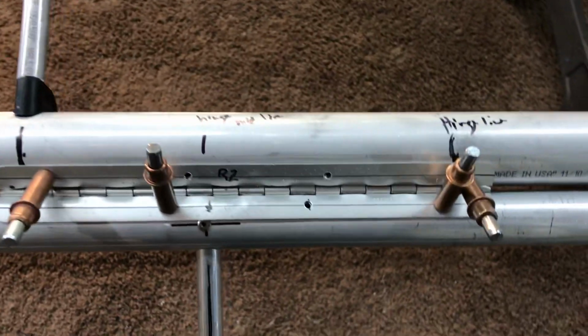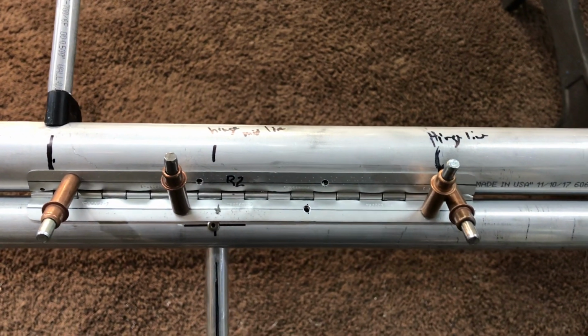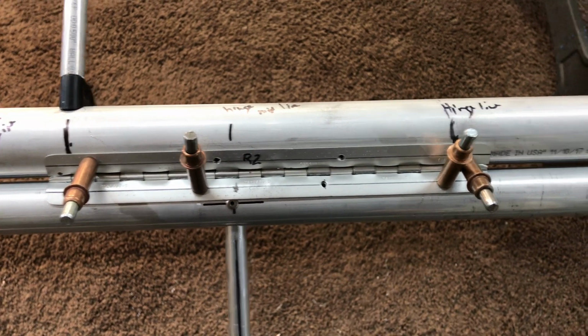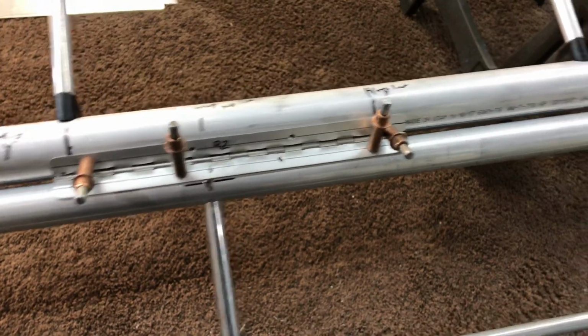Ailerons are all done on both sides. Ailerons over here on the end, and ailerons over here. I'm using piano hinges this time, as you can see in this close-up shot. Piano hinges instead of using the eye bolts like I did on the tail feathers, which are a real bugger to line up. So I chose to use these piano hinges. And you can see it's a popular thing in ultralights. Look at the Challenger ultralights. That's how they mount their ailerons.